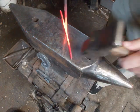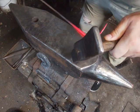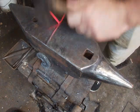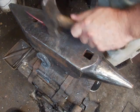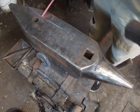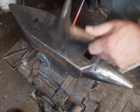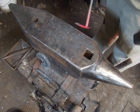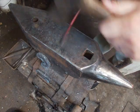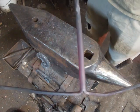Let's do the other side. It's a little awkward to hammer on but once you get used to moving it around it's not so bad, just because you're working with such a long piece. If you are drawing your tines out, you can work on one side however you need to, then bend it back up, flip it around, then work on the other side — so you get it to where you want it. You can do this during the rounding process too, but try to get everything back to the T-shape and flat.